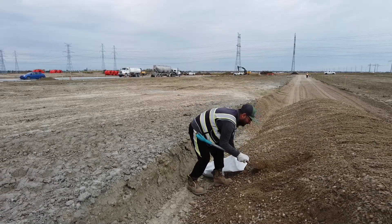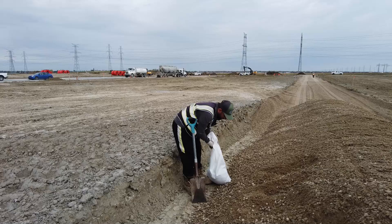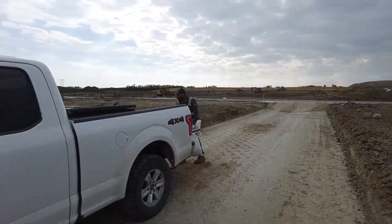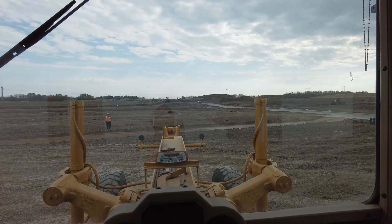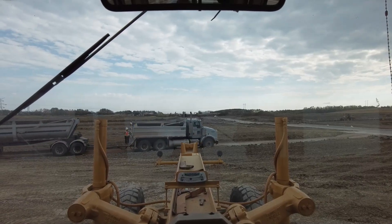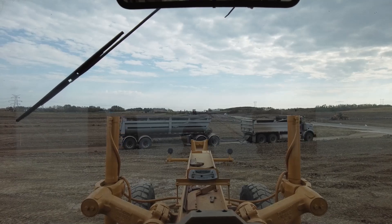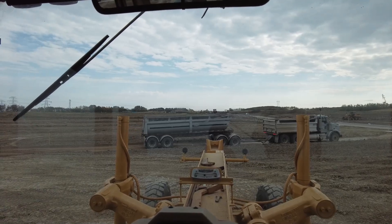The optimum moisture in this gravel is about 7%. The sample gravel is probably only about 3 or 4%, so we obviously need to add water. The quantity of water can be a tricky thing — if the percentage of water goes up to even about 8%, just 1% or 2% over optimum, the gravel will just fall apart and act like a mattress.